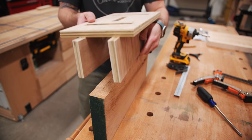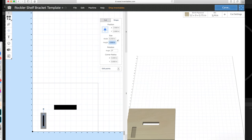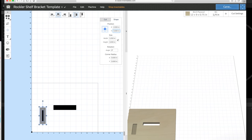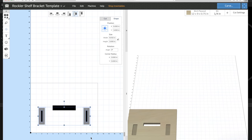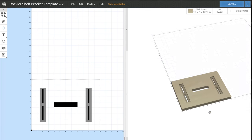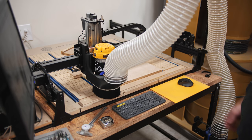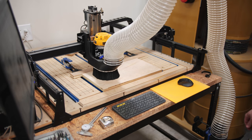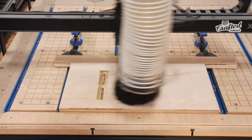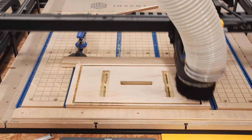Because I ruined this jig during this project and plan to use this same hardware again in the future, I actually decided to remake the jig after finishing all of the routing. The way I made the previous jig meant that it would only work on shelves that were the exact same thickness as the shelves I made in this video. Since I'm planning to use this same hardware with some double-stacked three-quarter inch plywood shelves in the future, I figured I could make an adjustable jig instead. So I whipped up a quick design in Easel, which is Inventables' free design software, and then headed over to my X-Carve CNC to cut the template. This is one of my favorite tasks for the X-Carve — I can make adjustments to this template in the future if I use different hardware, or I can just recut the template if my bearing slips again. This only took about 12 minutes to cut, so it would be super easy to recut this template in the future if needed.